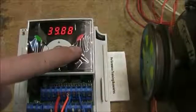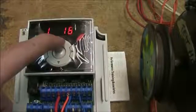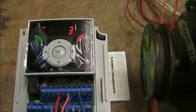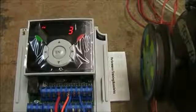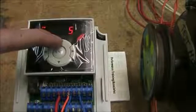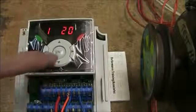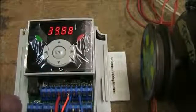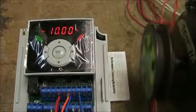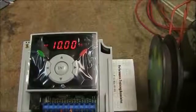I'm going to hit the right arrow key until I get to the IO group, navigate to I0, and go all the way up to I20. Hit enter — this digital input is currently set to 3, which is fault reset. I'm going to set it to jog reverse, which is a value of 27. Use the arrow key to make the value 27, then hit enter twice to accept it. Back on the main screen, when I make the switch activating digital input P4, the drive runs the motor at the jog reverse reference — the reverse light is on and the drive is running at the preset jog speed.